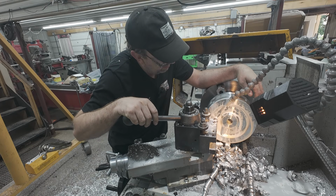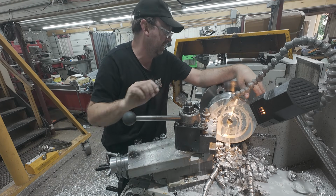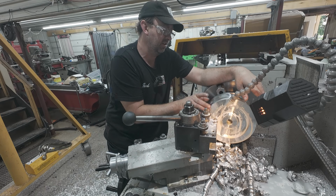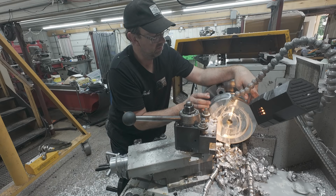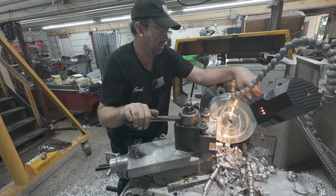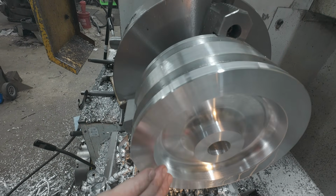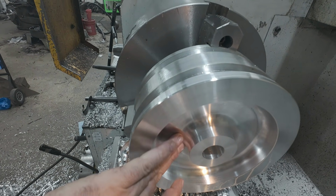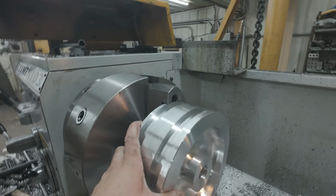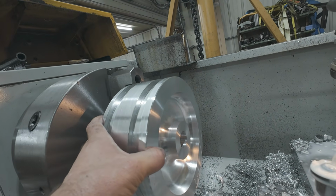Well, that's going nicely, but before I get too carried away, I'm gonna go run some volume calculations and figure out how much volume I have on one side versus the other and get everything dialed in right where we need it. And then we should be good to finish this guy off. All right, there she is. Wound up going 7/8 of an inch deep to compensate for the differences: the rod on one side and nut and everything on the other, so we're good here.